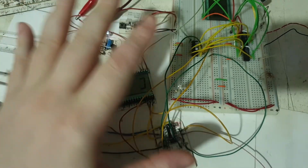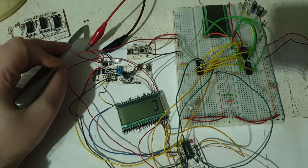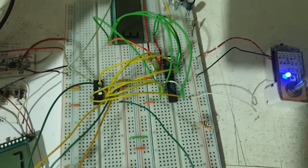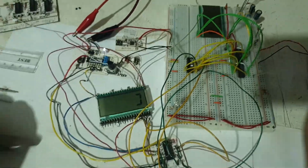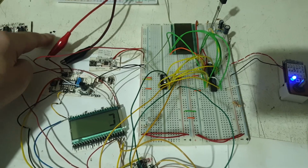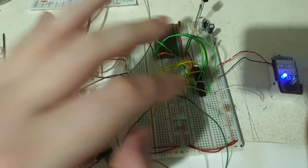And pretty much this is all that I tested. My conclusion, after all the errors that I got, is that these little gates, I was blindly trusting them, I was experimenting with them. But one thing I was asking myself: why does it work flawlessly without any kind of problem here on the breadboard, but here on the cardboard it is giving me a ton of errors? And one very interesting idea that I got is that I didn't insert these little gates here on the breadboard. They are nowhere. There are 2 chips, longer chips, like this one, and that's it. That's why it's working perfectly here on the breadboard.